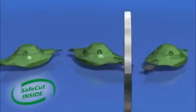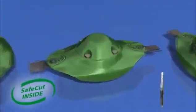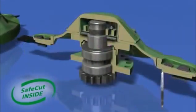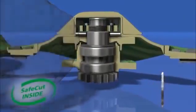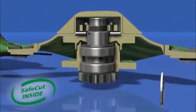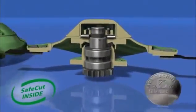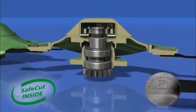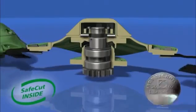Peace of mind comes from award-winning technology. The SafeCut Impact Protection System gives individual protection to each disc. As the disc hits an object, a roll pin shears. While the gear keeps spinning, it spins up on the thread portion of the shaft, and the disc moves out of the way of its neighboring disc, which eliminates any risk of further damage and expensive repair.